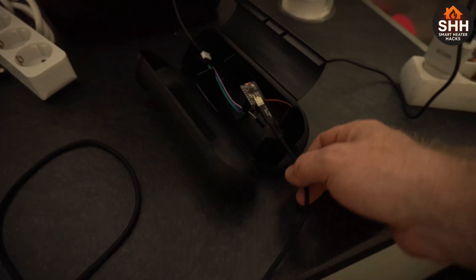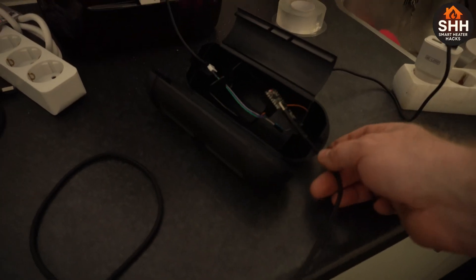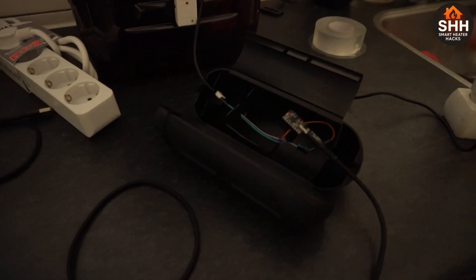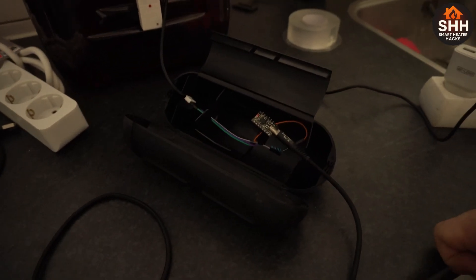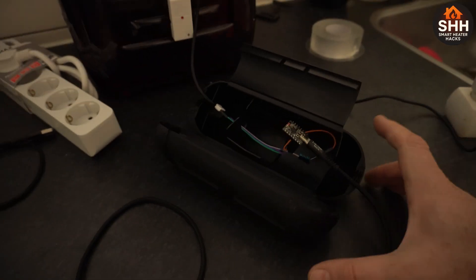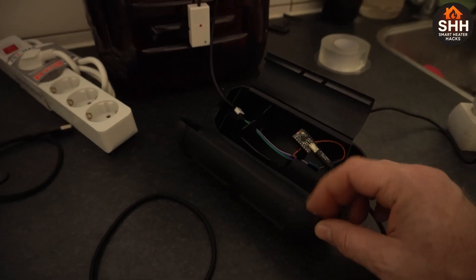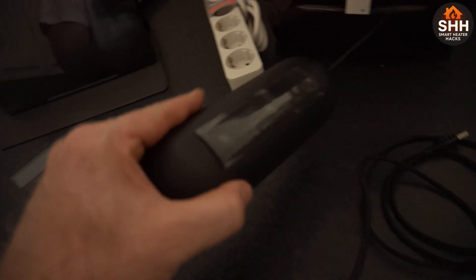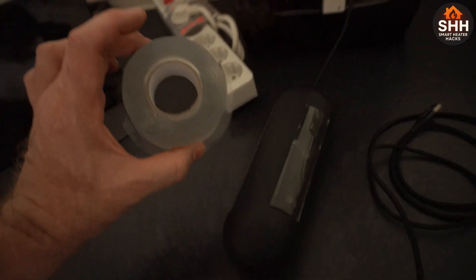Sticking something onto a jerry can is the better solution. I'm using these connectors — I'm not sure what they're called — but we use them in boats to keep water away from electrical equipment and keep plugs from shorting out. I've been using them for multiple years and never seen them fail. They're fitted with compression fittings and rubber gaskets so no moisture gets in.